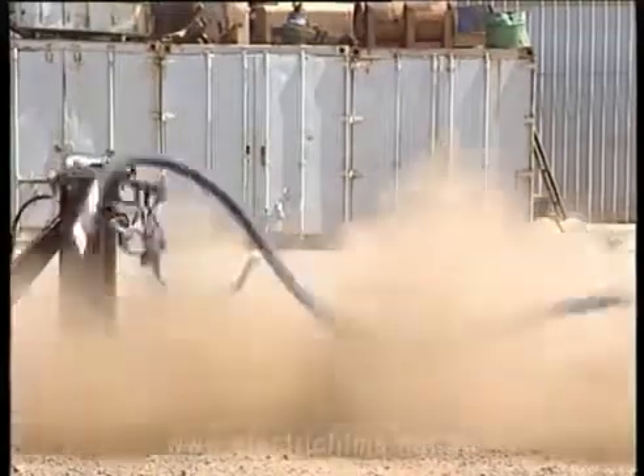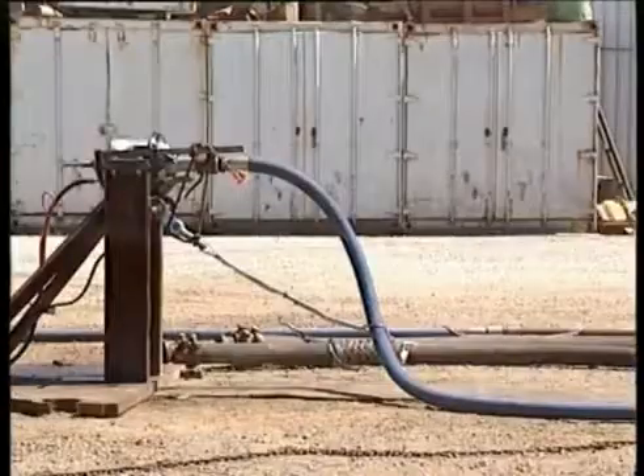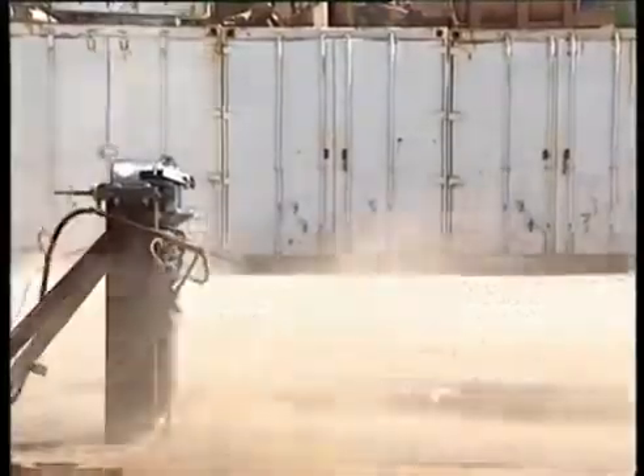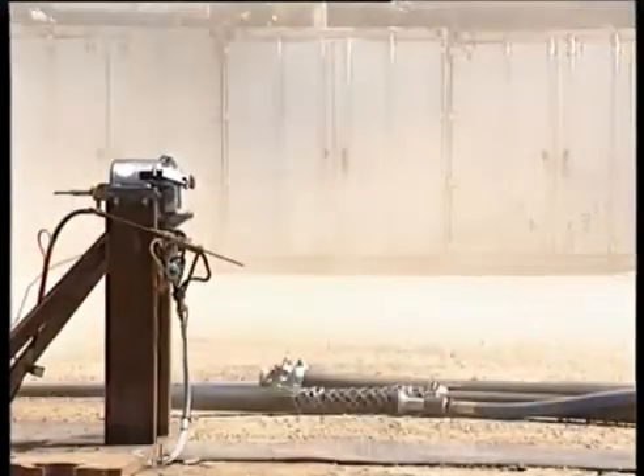The procedure was then repeated at pressures of 400, 550, and 700 psi. During this test, an 8mm sling-type whip check failed, with an indicated loading of only 65 kilograms.